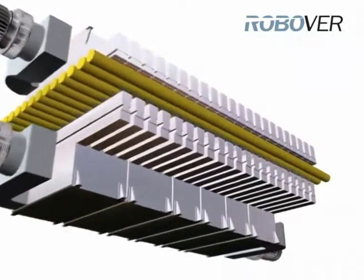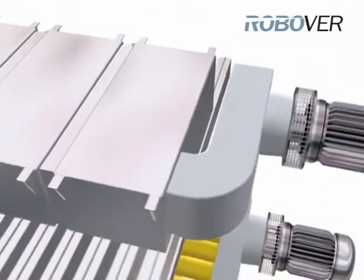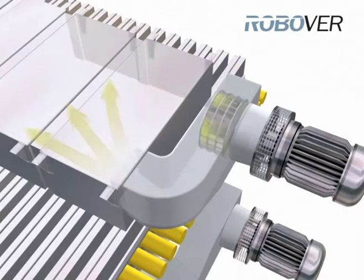The multi-convection system consists of four hot air blowers per section, which circulate the hot air inside the furnace. From the blower's air intake, the air is blown into the air distribution box. From here, the hot air is led into the air channels and the heating elements inside, thus eliminating direct radiation.